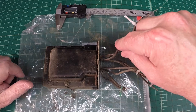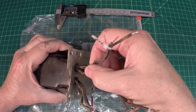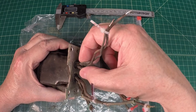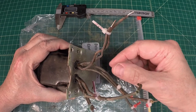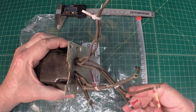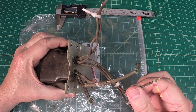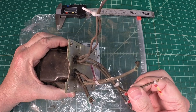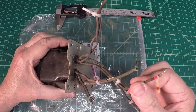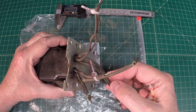This one right here is frayed. Down in here where it comes through there is a rubber grommet on the back, but I'm still concerned. I just want to make sure I don't have a short down the road. These high voltage windings — I was looking at about 700 volts RMS voltage according to my documentation — so we'll give these a good check as well.